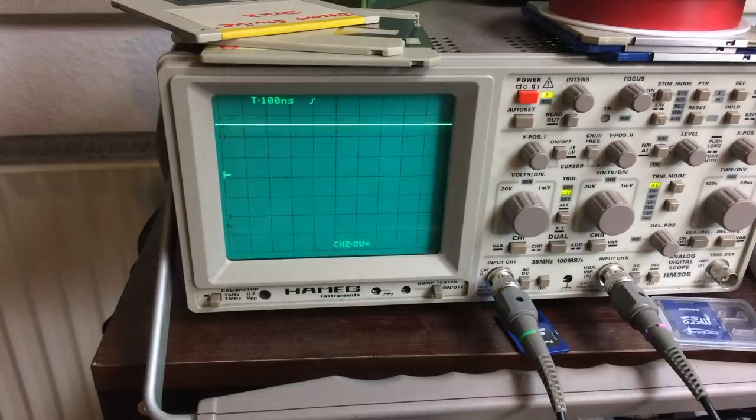Yeah, that's our reset circuitry. It seems to just be switching off again, switching on again. This is probing the processor at pin 40, which is the reset line, and this just goes up and stays. So this is perfectly fine.